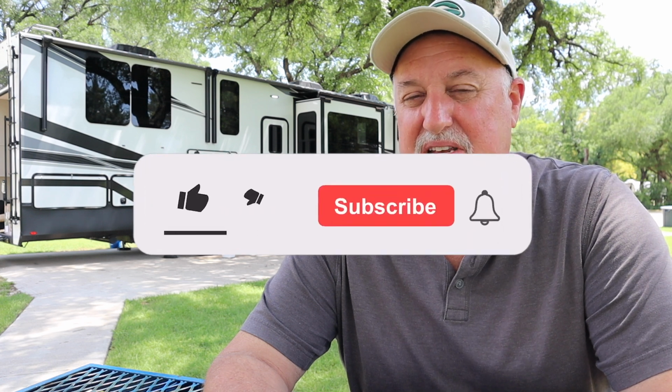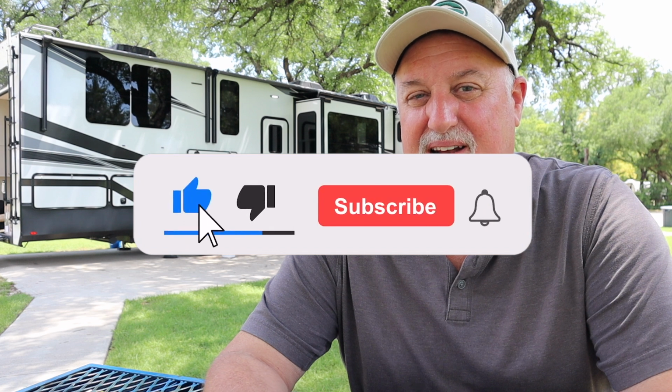And then we're also going to work on Mojo here behind me. She came equipped with the MoRide CRE 3000 suspension, which has wet bolts in the suspension. So for preventative maintenance, we're going to clean up and re-grease each of the wet bolts. And I've never done it on this unit.